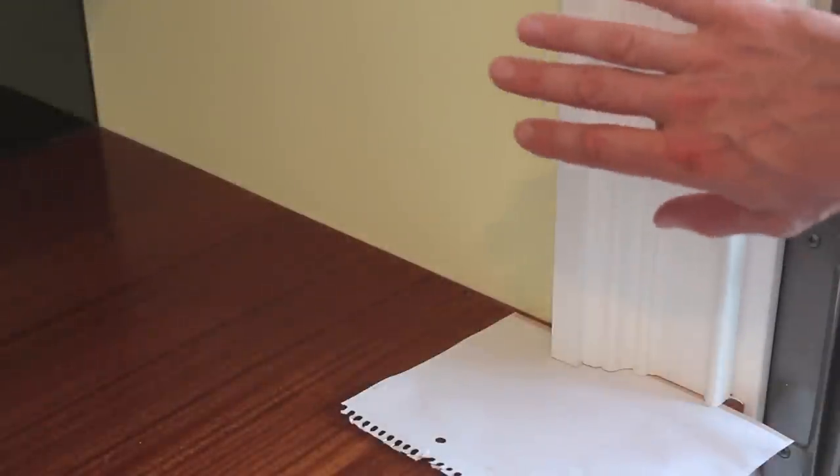I didn't make the kitchen cabinets for this job, but I did also do the trim work. My friend Steve suggested that I use a piece of aluminum flashing and put it underneath the molding, which would make it easier to paint the molding. And also, it keeps the molding just a little bit off the countertop, so again the countertop can expand and contract.